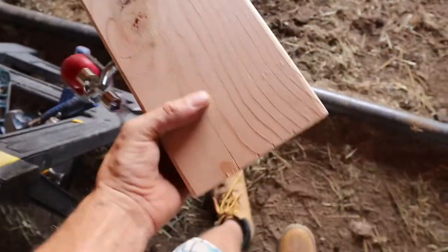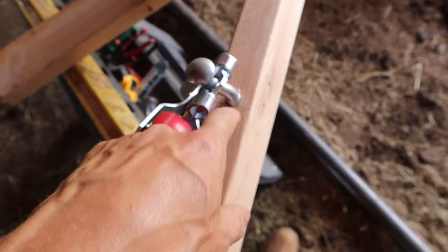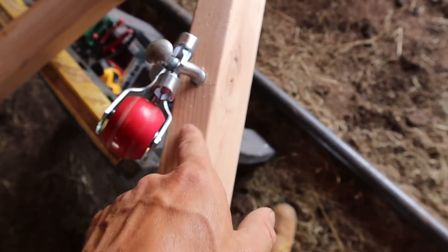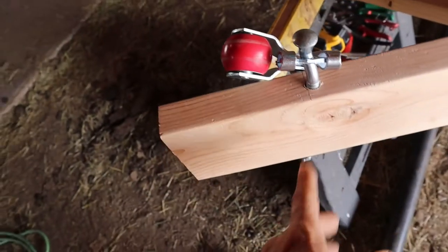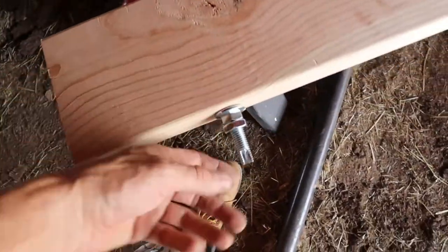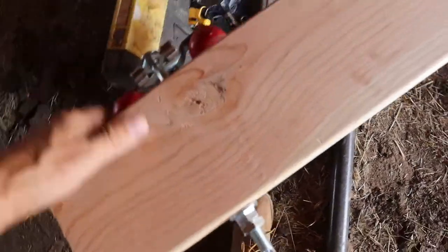Anyways, you take a half inch drill, get it centered directly sideways, so 3/4 inches in, and center this way, straight up and down square this way. Drill the hole, you slide it in, and it's got a thread for nuts to adjust it up and down.